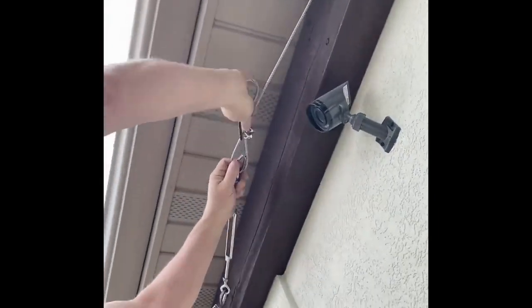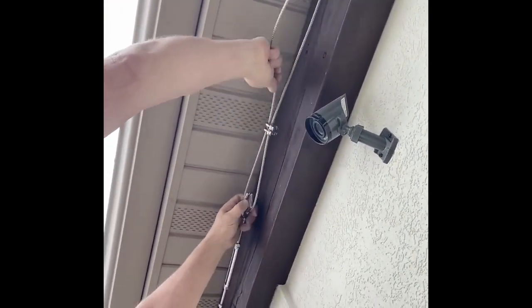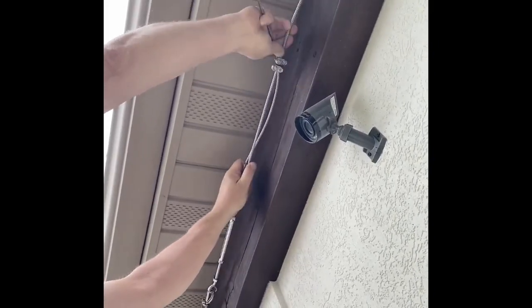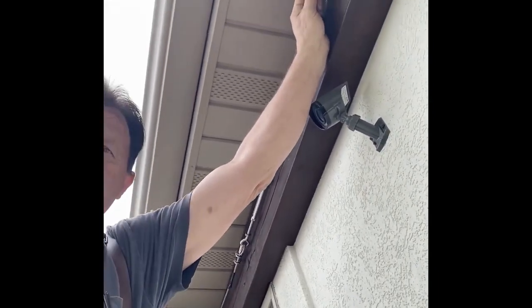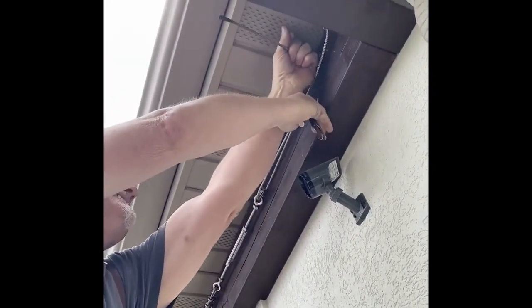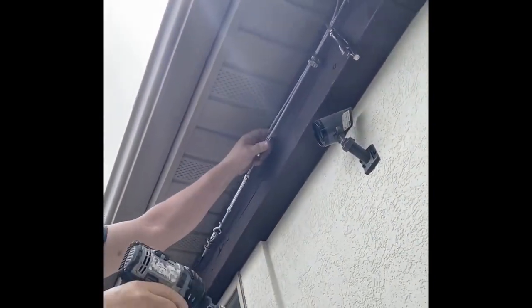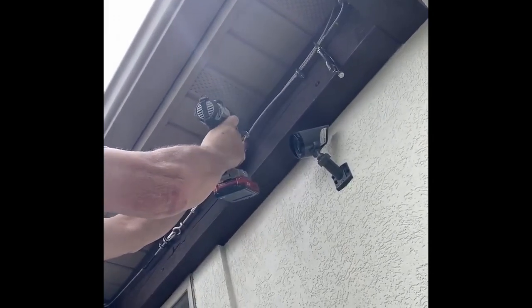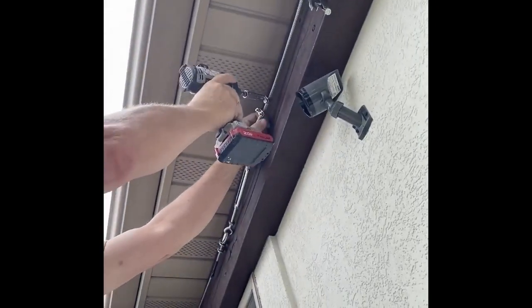Pull it and take out all the slack of the cable. Try to position your turnbuckle so it's right in the center. Have a needle nose pliers handy in your back pocket, ready to clip on and hold your cables while you put on and tighten the last cable clamps. Tighten these clamps in a crisscross pattern, just like you put the lug nuts on a car.